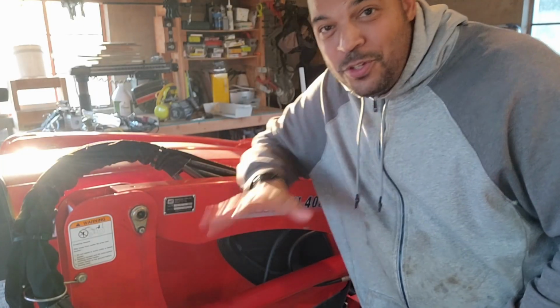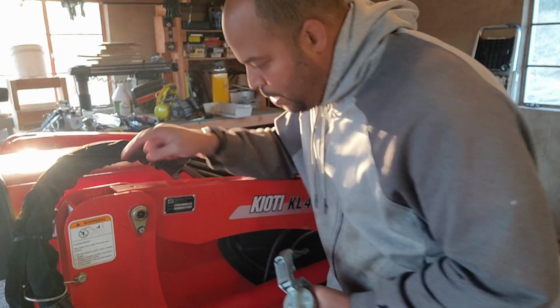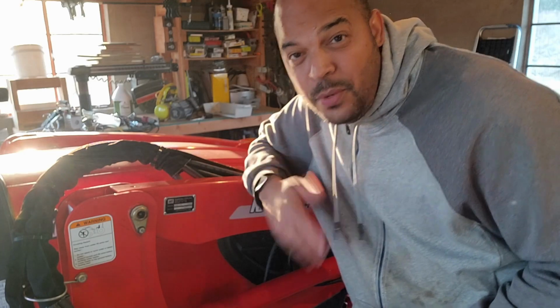So that's it for the Zerk fitting. That's how you do it. You squeeze, pump until you start to see some of the lubrication flow out, or at least that's how I do it. If there's a different way of doing it or a better way of doing this, drop us a comment. Let's all learn together.